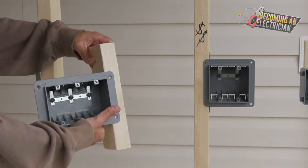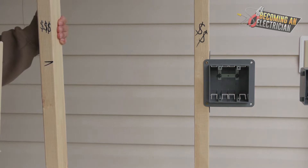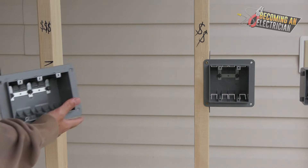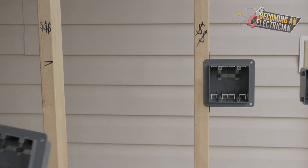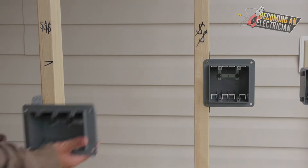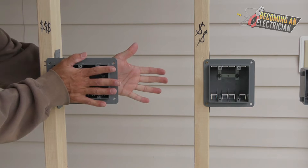When you're using a three gang box you're going to need to support it with a piece of wood. This is a two by four wall, so you'll need a two by four. If it's a two by six wall, it needs to be a two by six. The whole point of that piece of wood you screw on the other side is that when installed it is essentially sandwiching the box.